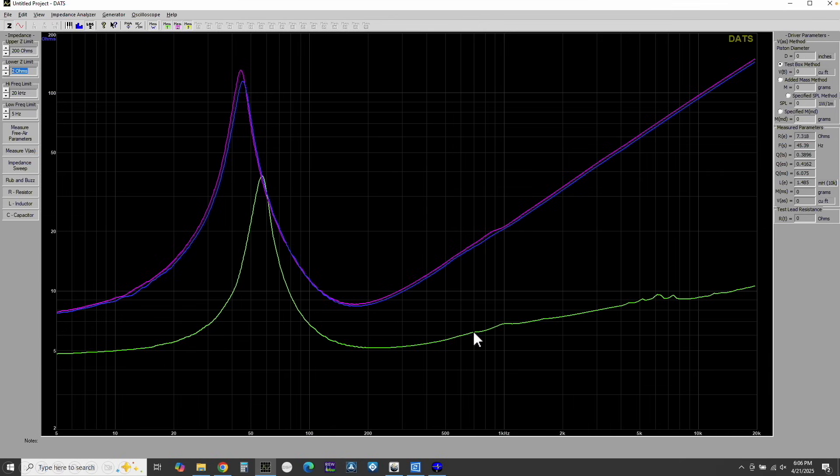You can probably ignore some of the peaks and dips here because I took this measurement just by holding the speakers by the magnet. If I were doing this for absolute certainty, I would mount them to a baffle — an infinite baffle or a quasi-infinite baffle — and then sweep the impedance that way. But just to get an idea of whether these are all the same drivers, holding it by the magnet is sufficient. Those artifacts are probably reflections from my hand.